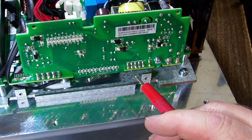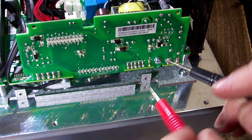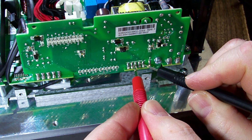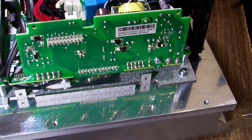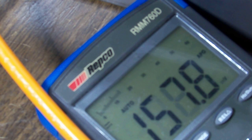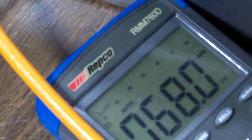I can see it marked on the board here: minus 15, plus 15, VCC, and a ground. So let's see if those are present. Checking for our 15V... nothing on VCC. But look at that — our plus 15 and our minus 15 are flickering all over the place, like it's trying to start up but not able to. I've got a scale across the top and you can see that scale is flickering all over the place because it can't achieve full voltage.